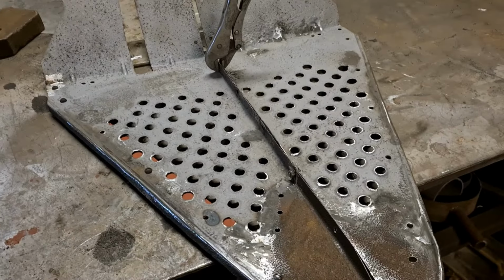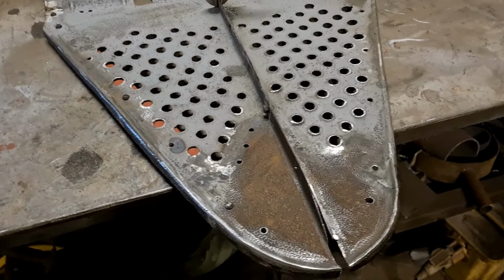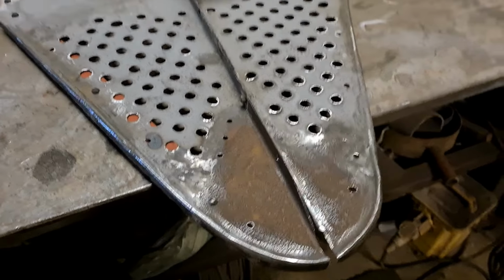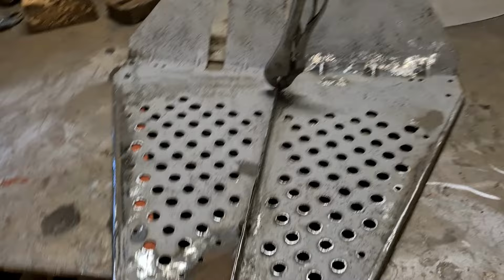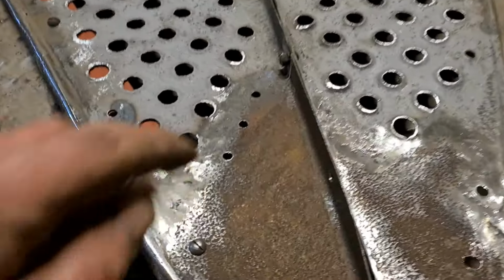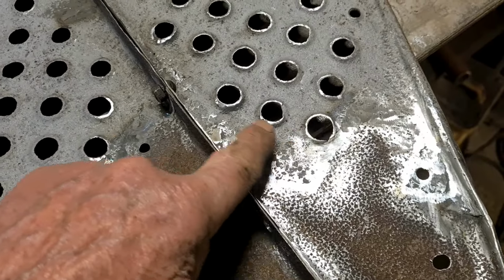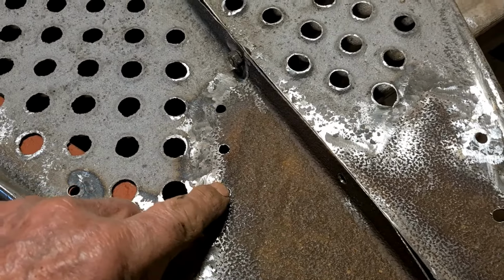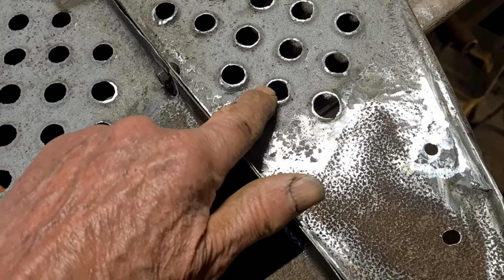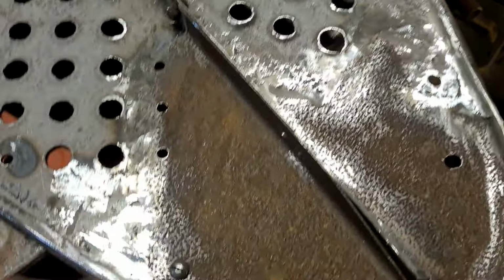Okay then, so we finally got a pair of foot plates finished. Other than just blasting them to clean the new bits up, and all the bright bits, so it gives the paint a nice key. But I have got to drill them holes. I've got three holes there I need to drill out, because they're the three that's missing, like them three there. So I've just got to drill them out, and then I'm going to make a punch set to put in the fly press, so I can just get the raised piece for your grip for your boot, and then that'd be pretty much all sorted.